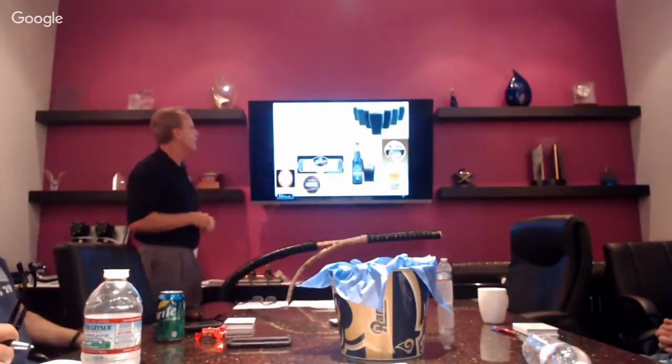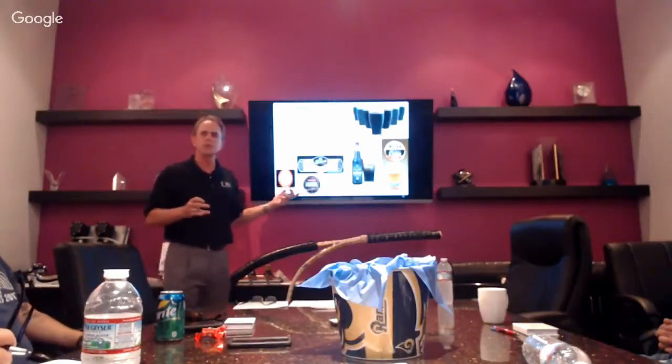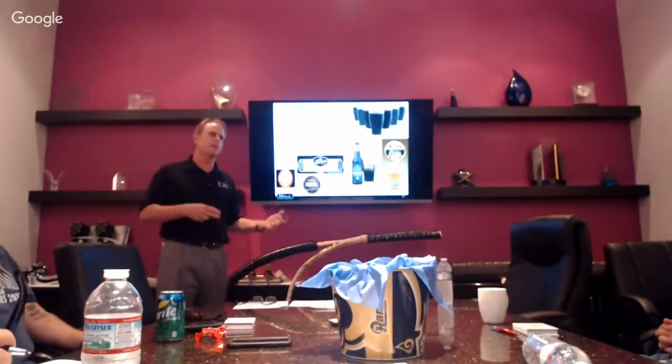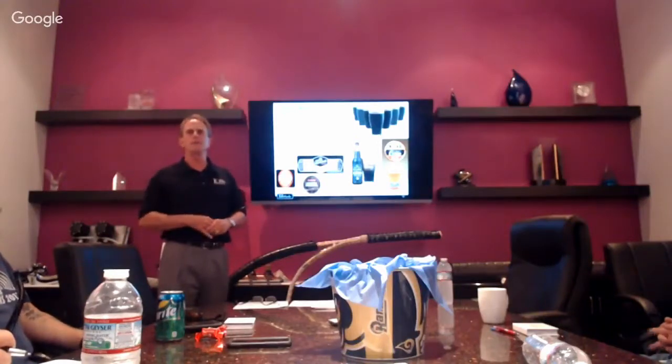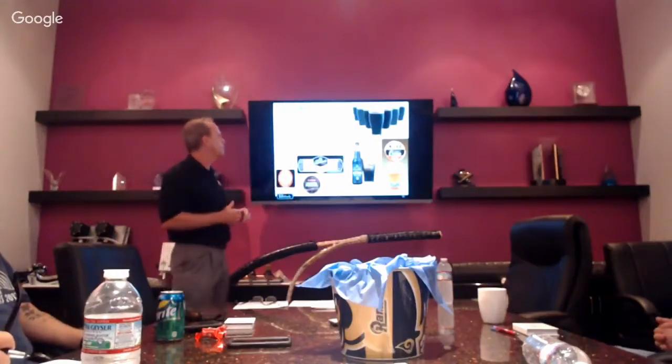Mechanical blender and our nitrogen regulator. Nitrogen beer, that's usually a blended, like I was talking about, 75-25: 75 nitrogen, 25 CO2. Some guys might put in straight nitrogen, but generally it's a blended.